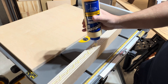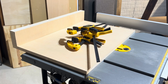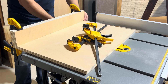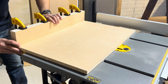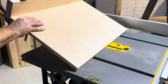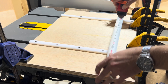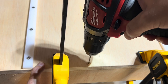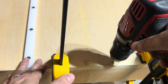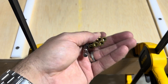Glue up the rear fence prior to securing it to the base. The position of the rear fence doesn't need to be a hundred percent accurate as its main purpose is to add overall strength to the sled. Align it with the edge of the base and clamp it down, allowing a couple of inches of space on the ends and in the middle, being cautious of the blade location. Flip the sled over and clamp it down. Before securing the fence, mark where the blade location will be — 12 inches over for this sled. Use an eighth inch drill bit to pre-drill, then drive in a two inch screw on each end and in the middle on each side of the blade location.